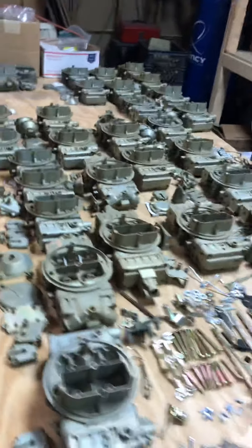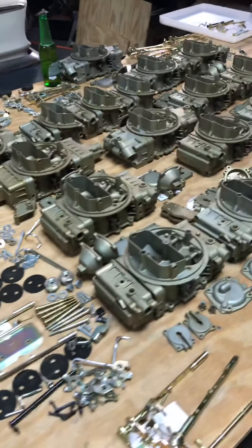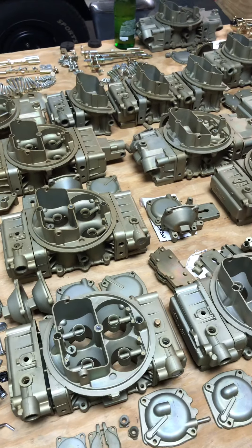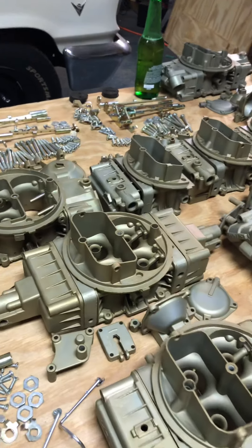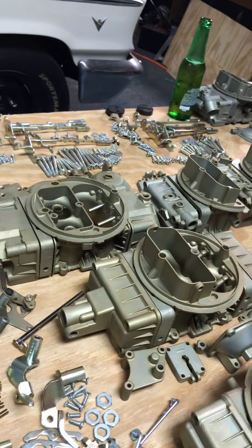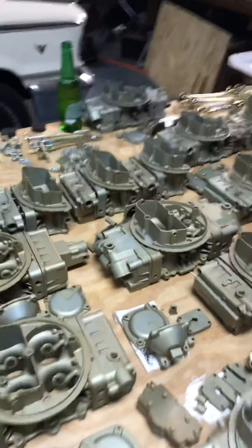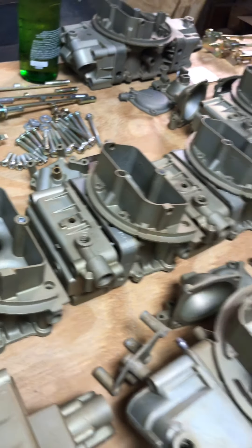For the black you really need a very thick zinc layer — you'll get patchy results if your zinc coating is too thin, simply because the chromate eats what's left of the zinc. I do not plate castings the same way; you have to get them super clean and then activate them with some sort of acid.